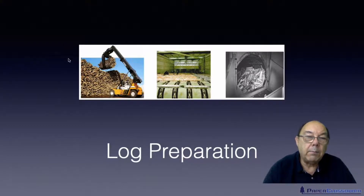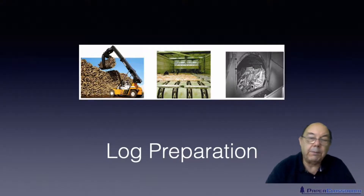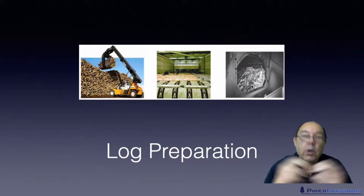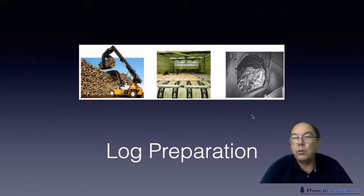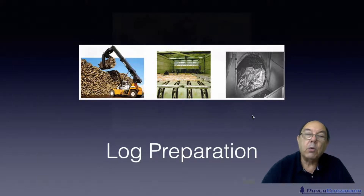The mill brings in logs that have been cut down in the forest and puts them through a device with blades that chop the logs down to about one meter in length. They're then tumbled in a debarking drum at fairly high speed, causing the logs to rub against each other and knock all the bark off. The bark passes through perforations in the drum wall and is collected outside — usually used for biofuel — and the debarked logs come out the other end.